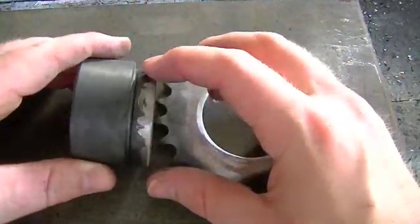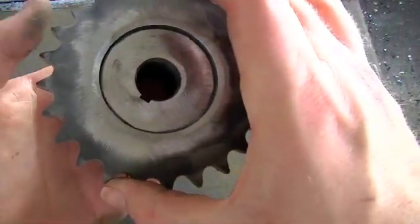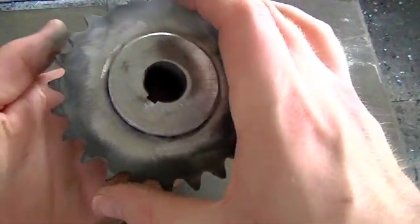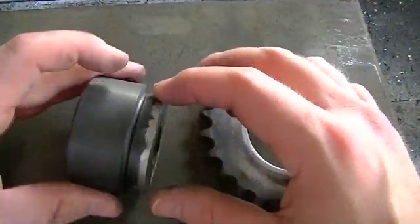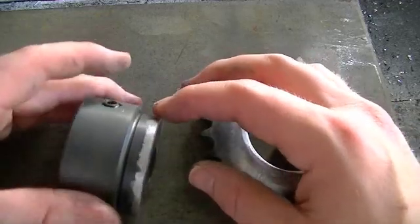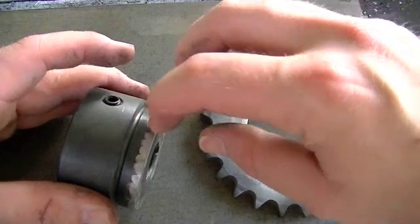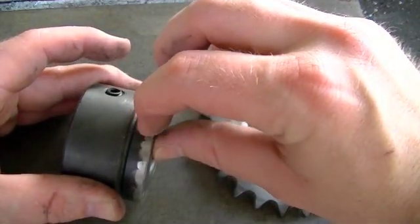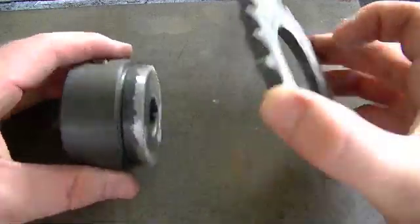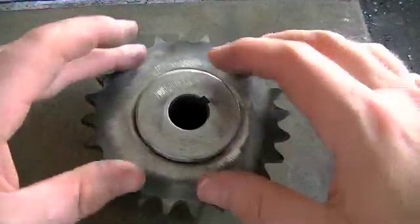One thing to note: take caution around this area. This is a machined fit, so they're supposed to fit together real snug. But you do want to get some of that black oxide coating off of this area here. Just be careful, just kind of nip it with the grinder — just enough to get the coating off. Don't go too deep, because you are taking some material off. Leave some there so you still have that machined fit, and when you get the sprocket all welded together the thing still runs true.